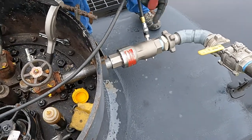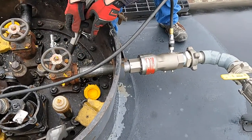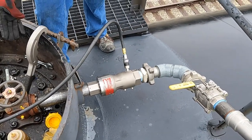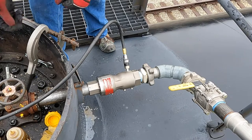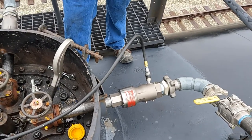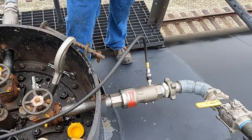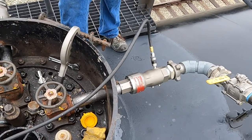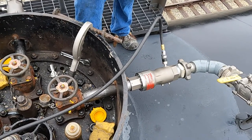Now's the time — if that was still leaking, you tighten this down again until it quits. But if you only need 20 to 40 foot-pounds of torque on this to close it, don't use 60 or 100. It's the proper application of force — that's all we're after. It's to do the job and to do it safely.